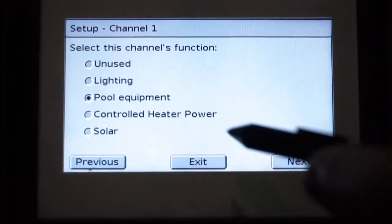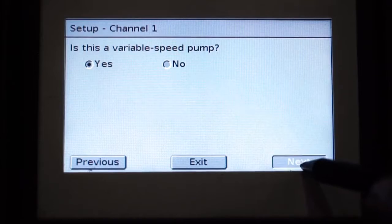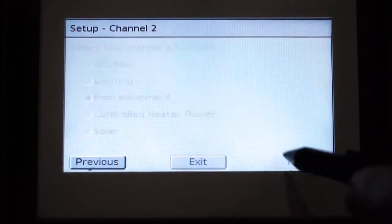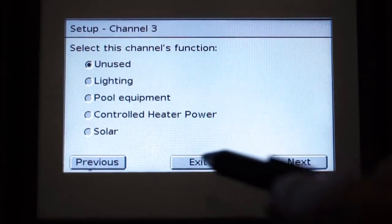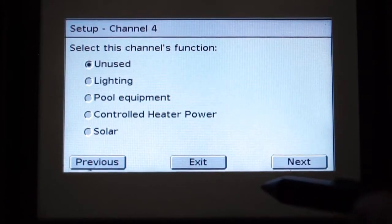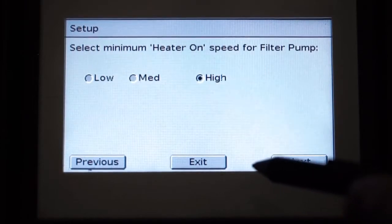Now through our channels, we've already configured our pool equipment. Filter pump on channel 1, variable speed yes, timers in AI mode. Our channel 2 is currently configured with our cleaning. Now what we're going to do is put our controlled heating power onto channel 3. Next, channel 4 is unused, 5 is unused, 6, 7 and 8 are unused.